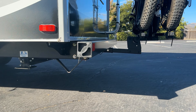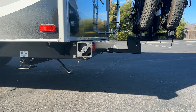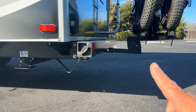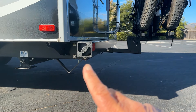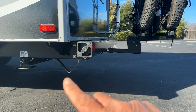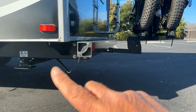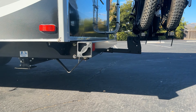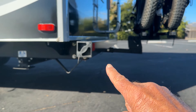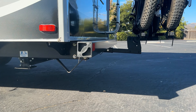One thing I wanted when I built this was to have the receiver as close to the bumper and as high as possible, so that going up or down a driveway approach, nothing over here would be scraping. I'm fortunate because I have these stabilizers — if I hit a driveway approach I'll feel or hear it first. Some units you can buy online position the receiver lower, and I didn't want this even getting close to possibly hitting anything. So watch for that if you buy or make one — make sure it clears.